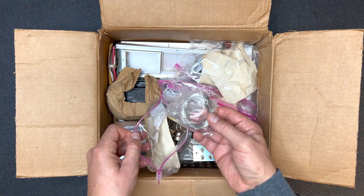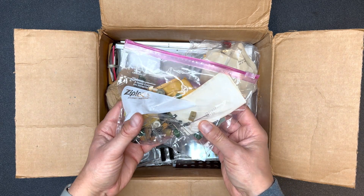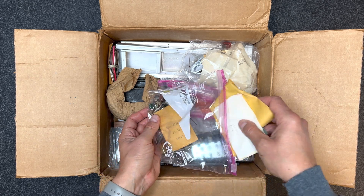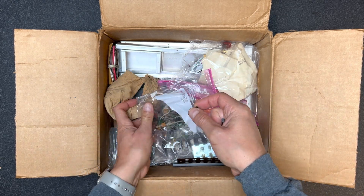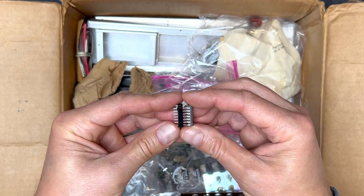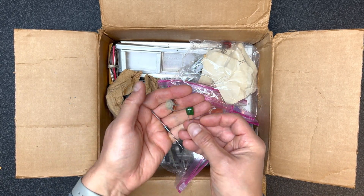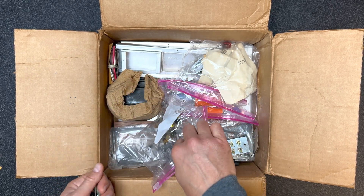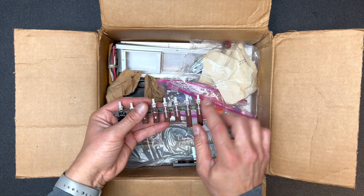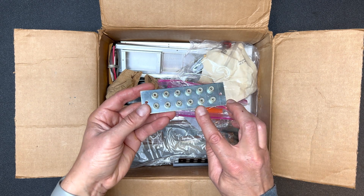The power cord. A goodie bag with some solder. Potentiometers. The ubiquitous Heathkit nut starter. AC accessory outlet. Here's another bag — and no, Heathkit didn't supply their kits in Ziplocs. This kit was probably harvested for parts and the person I bought this from did their best to restock it. Inside we have diodes and an IC marked 44241. I believe this is the gain amp for the phono stage and they've provided a socket for the chip. Here's a trimmer — these are probably going to allow us to balance the phono levels. A mylar capacitor and diode. The switches — these are all pre-mounted in this assembly, and you can see the four input switches are mechanically linked so that only one can be activated at a time. The RCA jacks, looking a bit tarnished, but no worries — I can polish that right up.